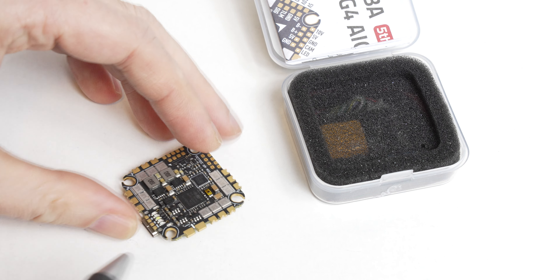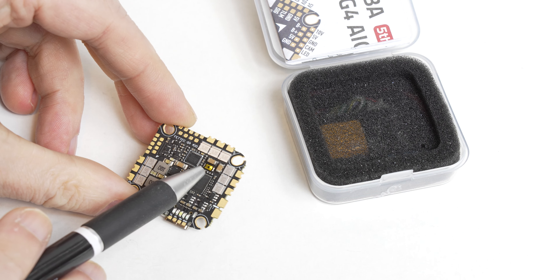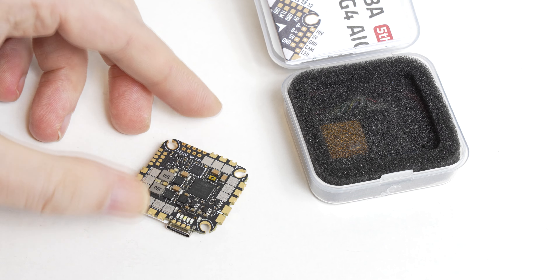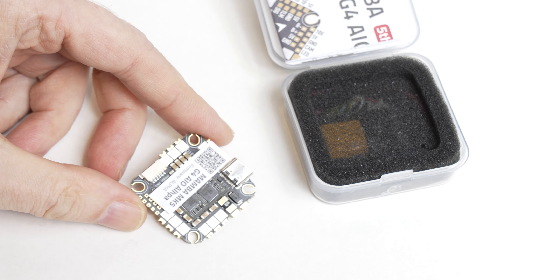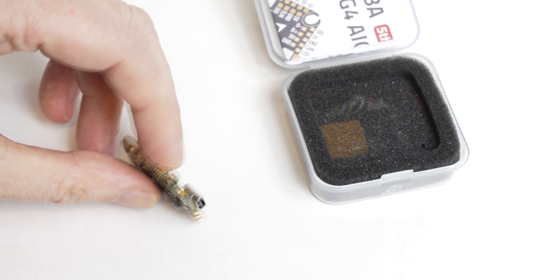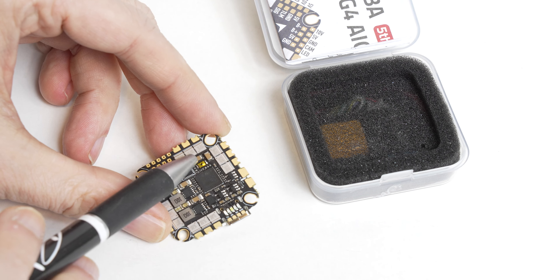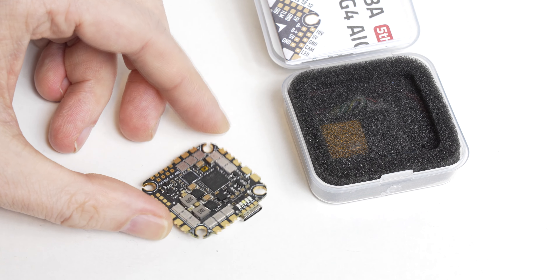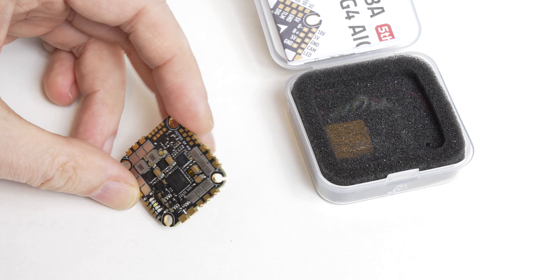The power tabs at the bottom are pretty big actually. I now see a button over here which will probably be the bootloader button, and it's at the bottom — so be aware of that. It actually looks as if this is the top of the board, but the USB connector appears to be at the bottom, which is pretty uncommon. The bootloader button and the bigger motor solder pads are also at the bottom. It depends on your build and how you set it up.